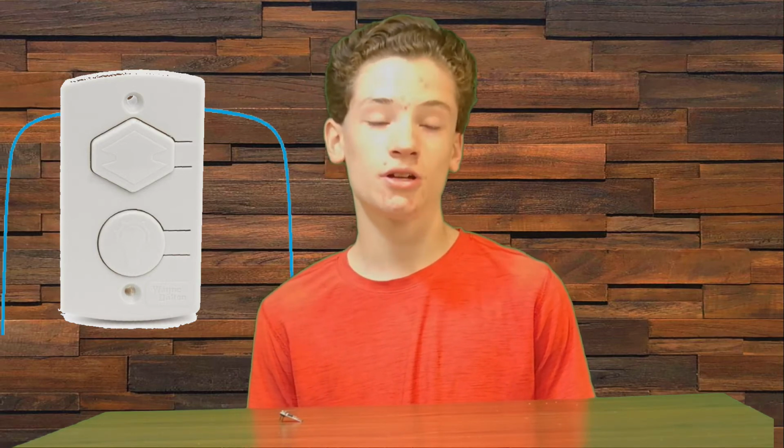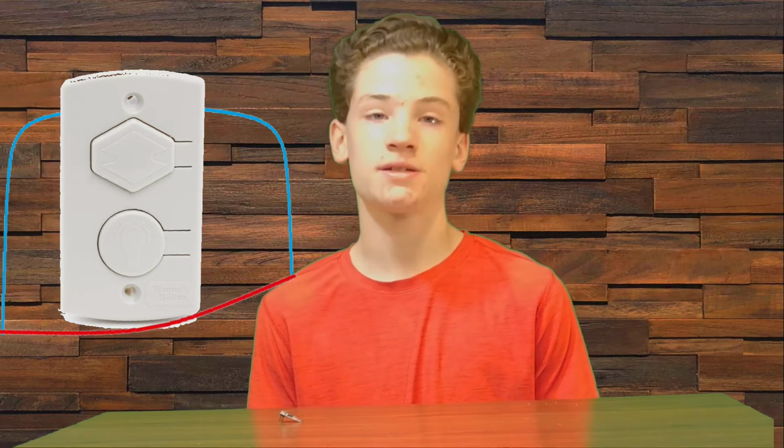So basically, what you do with this microcontroller is you buy a header to breadboard converter, and you plug that into a breadboard, and then you wire it up properly. So how I did this is the garage door buttons on my garage door, the buttons you press to open the door and do the light, the one for the garage door, I took the box off the wall and attached wires to each side of the contacts of the button, so that now you have two wires that when they're connected, it presses the door button.